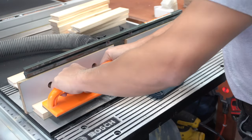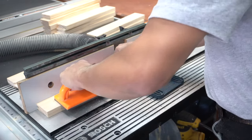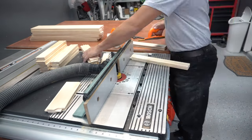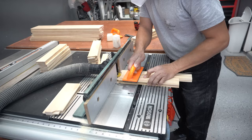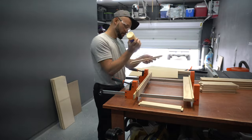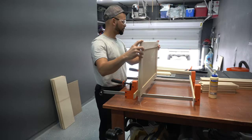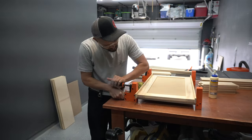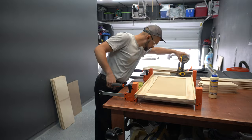To build my doors I install some tongue and groove bits in my router table. I make sure to mark all my pieces on the top side first, then run a slot across all my stiles and rails. Finally I use the groove bit to cut tenons on my rails, making sure to use a scrap piece behind to avoid tear outs. I use panel clamps to square things off, add some wood glue to the joints, attach the door insert and apply clamping force. I also add some 5/8 inch brad nails to hold them in place and add wood putty to cover the holes later.